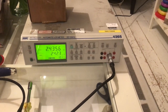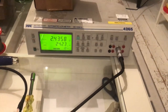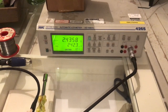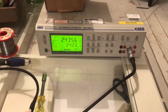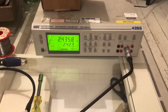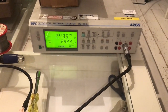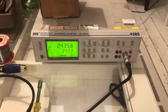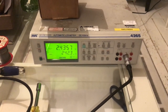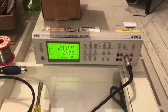Both tuned down below 530 kilohertz and neither got beyond about one megahertz. I fiddled around with the design, taking turns off and adding turns, and didn't really get anywhere. But then I remembered at work that my company makes superconducting magnet coils, and the magnetic field intensity they generate is dependent on the number of turns, which gives you the inductance. When winding a superconducting magnet you need to know the inductance of the coil.